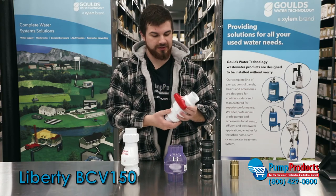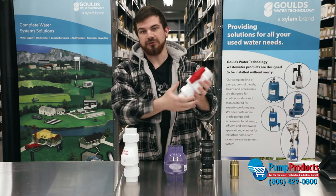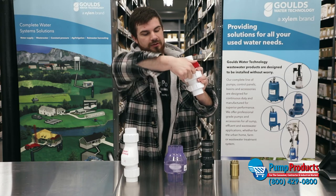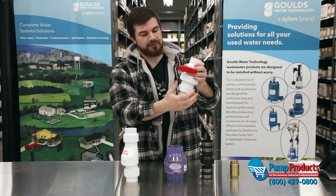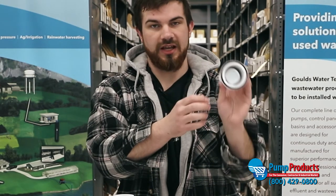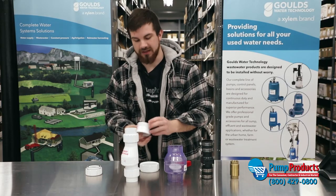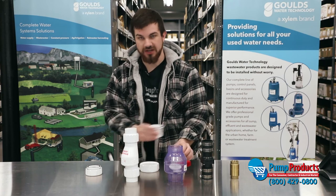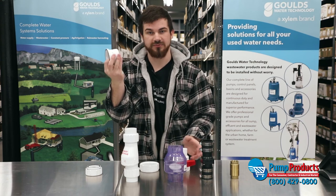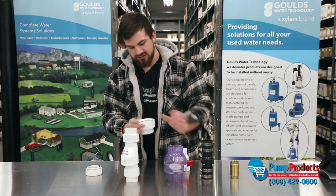This is one of my favorite check valve styles — it's a combination unit featuring a ball valve, check valve, and union connections all in one. To install it, the ball valve goes on top; you turn off the flow, then remove the union connections to check for clogs, damage, or deterioration to the rubber. Instead of cutting out and replacing all the piping, you simply swap out just the one check valve part and you're back in business — quick and efficient.